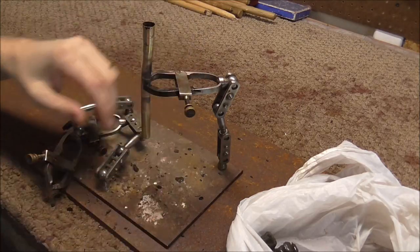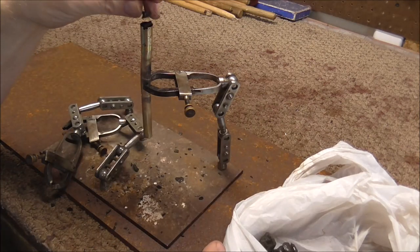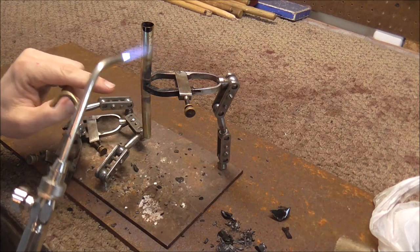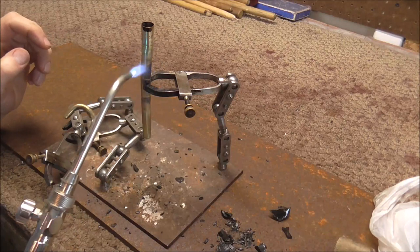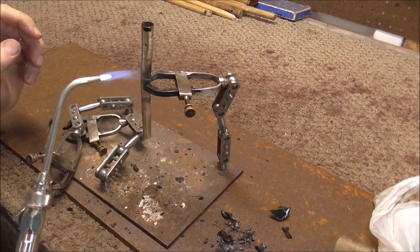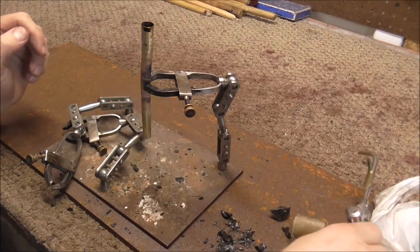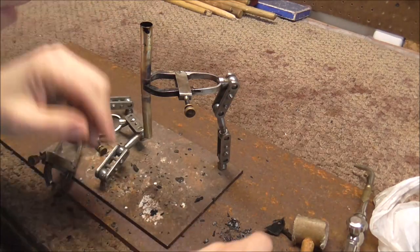This can be a dangerous job if you do not know what you're doing, so I suggest you only try this if you're experienced with brass instruments. The reason it can be dangerous is if you heat it in the wrong way — if you heat it in the middle and the middle expands but the sides do not — the tube can explode. So you need to be very careful. Pitch does burn, so if you do try this, make sure that you have a fire extinguisher handy. But you can still watch and enjoy seeing it being done, even if you don't do it yourself.